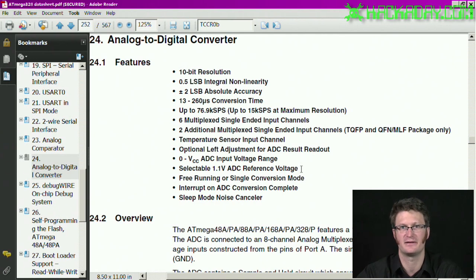I haven't delved into the datasheet deep enough on the accuracy, but what you can do is measure the voltage of that 1.1 volt reference — essentially a voltage regulator. As your voltage is dropping from the battery, the read voltage from that will go up. Doing a backwards calculation, you can figure out what voltage your battery is at. That's something I do on some of the things that I produce and ship on my own, and it's a pretty handy feature. On my particular processor, I think it's a 0.9 volt reference.